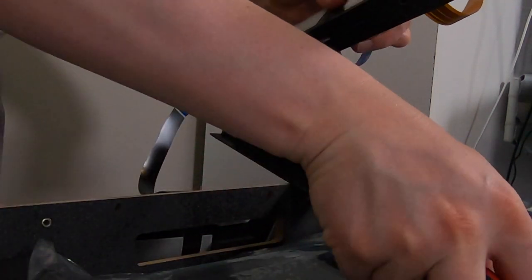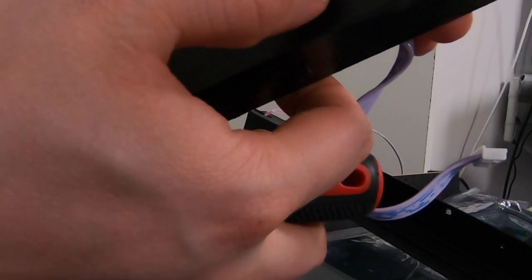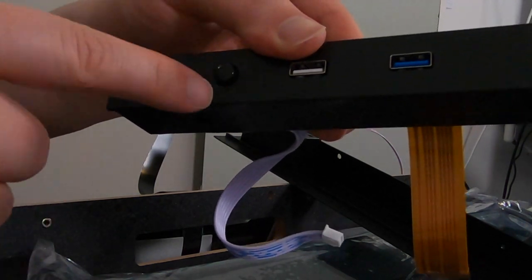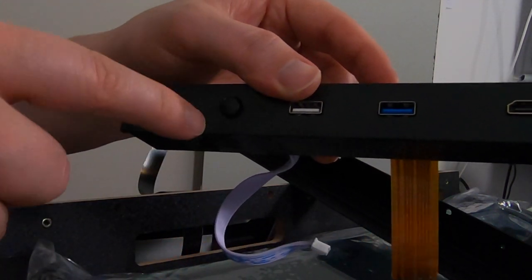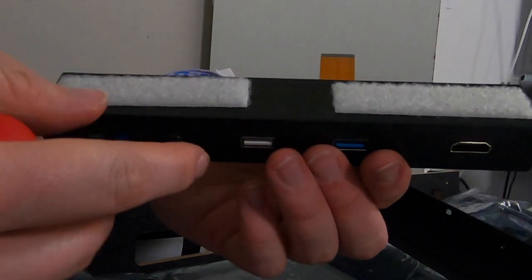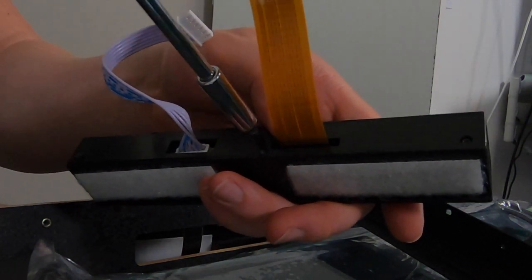Put that to the side and push the piece back down. Double-check your channel button still clicks, because if you loosen the screws too much and push it out, there is a plastic piece that sits inside two nubs - those nubs hold it, and the middle piece pushes in towards the tact switch inside. Make sure that's all set in there and fully working before you button it back up. If that gets loose you'll have to fully take all the screws out and reset the plastic piece in the nubs.